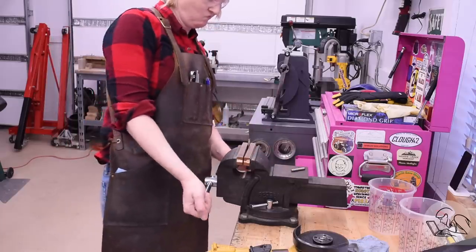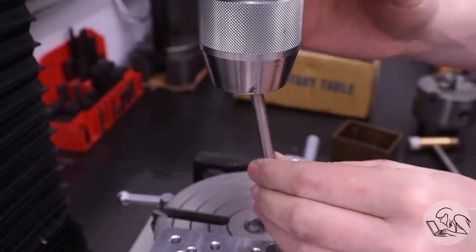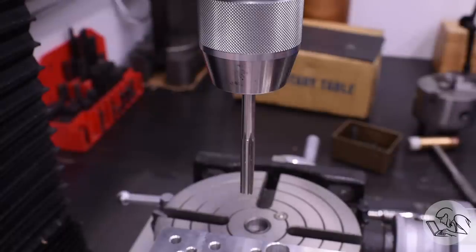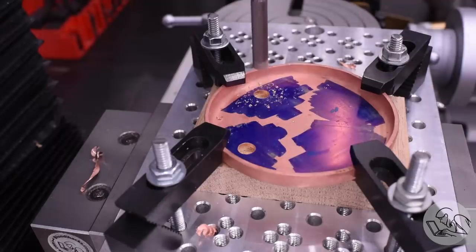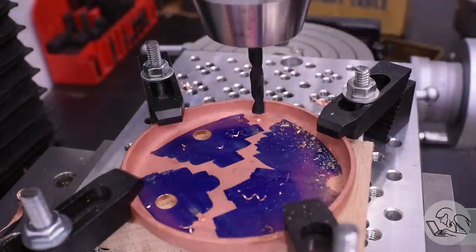I can't wait to order a stubby reamer in this size, and also it's a very cheap import reamer that I really don't care about, and it's not a common size that I use a lot, so I just made the decision to cut it short so that I could keep moving forward here. If I need a longer reamer in this size, then I'll buy a higher quality one anyway, so here we go. Luckily for all the other reamers on this particular job, I had collets that would fit, so I didn't have to cut anything short.